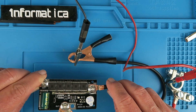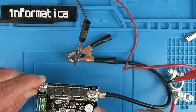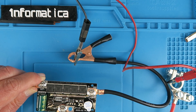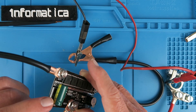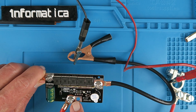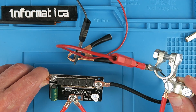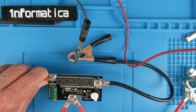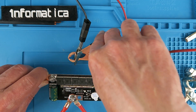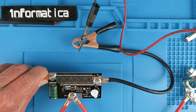The unit is assembled now. Not really much to do apart from making up the leads with these lugs, putting in the little speaker — positive is indicated on the board — and fitting the capacitor, which is clearly indicated on the board with the negative side. Although there are two holes here, it seems to make sense to bolt both wires together there. On the positive side I have a traditional battery clamp, but I'm not overly keen on having something bolted to the battery which I can't disconnect should something go terribly wrong. Therefore I've elected on the negative side to use a crocodile clip — we'll have to see in practice how that works out.